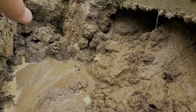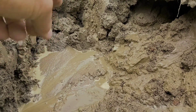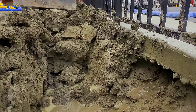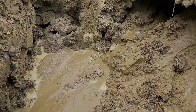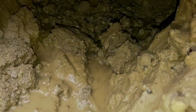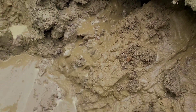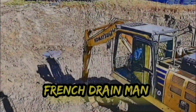If you're pouring new concrete on clay, you need a drainage system. If you hire a concrete guy who doesn't understand drainage, he'll think you just mean pitching the cement away from the house — taking care of surface water. That's great if he even knows enough to do that, because I've seen cement pitched toward the house, which creates a lot of work cutting concrete and installing channel drains. When hiring a concrete contractor, go into great depth on the drainage he's going to include. Don't let your hard-earned money be for nothing — do it once and do it right.